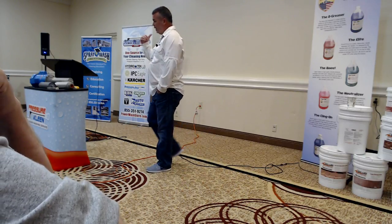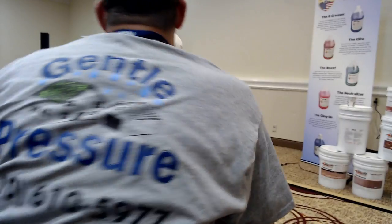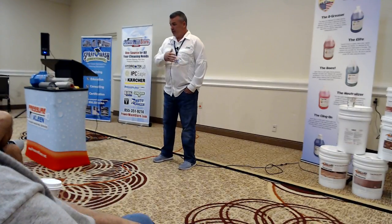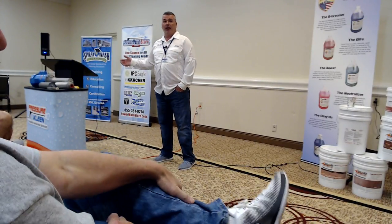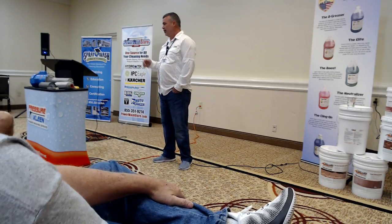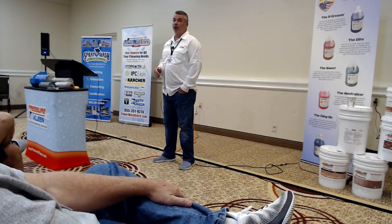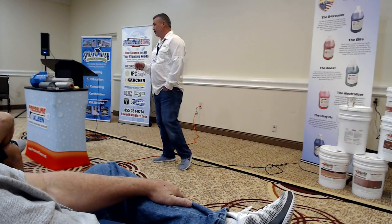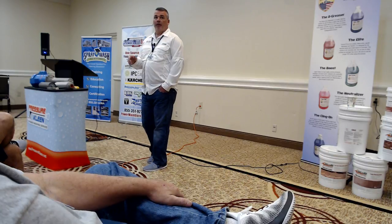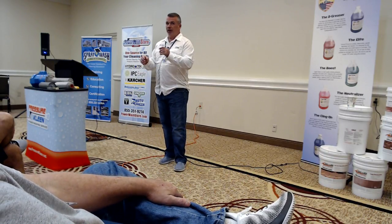When Jose came over, we had to replace some diffusers, and he bought all diffusers and all impellers and everything for it, and we didn't need but one impeller in the whole bunch. If you replace more than two or three impellers, you've put a hurting on that thing. That's a lot of damage to one of these. If you do have broken diffusers, check the impellers for broken pieces of plastic too.